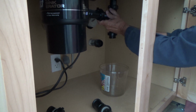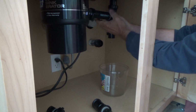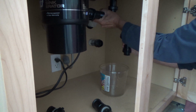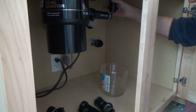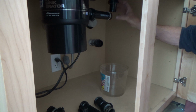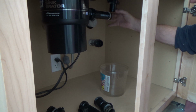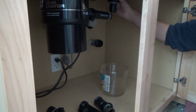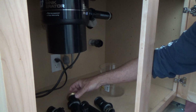Okay. And see, I'm going to have to unscrew this first so I don't. Maybe not. Okay, here we go. There. Okay. All that. Now I can unscrew that, pull that out, and I'm going to leave this top one alone. I'm just going to leave it on this sink extension there. I could loosen up this brass fitting there with a pair of channel locks and take this last piece down. You know? Oh, I thought if it's loose enough, I'll take it down, and look at that. It was loose enough. Got that pulled out of there.